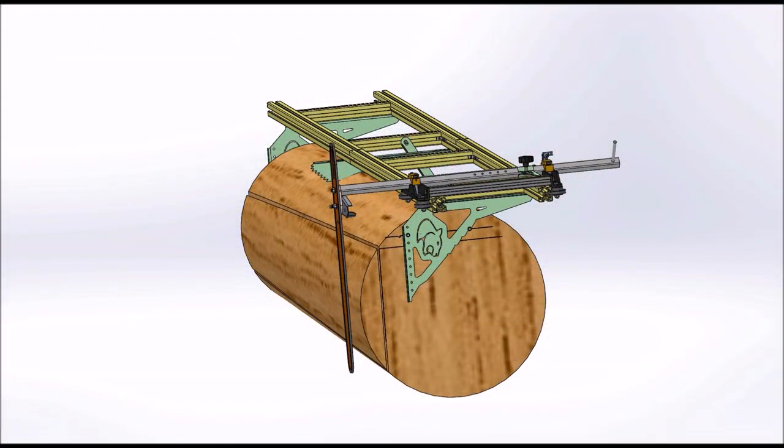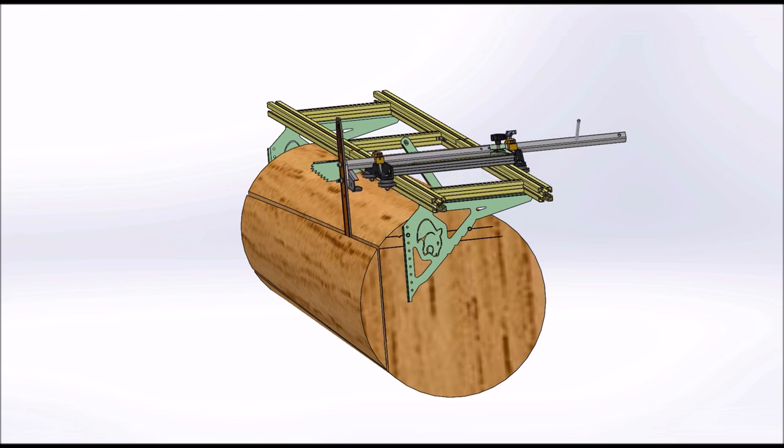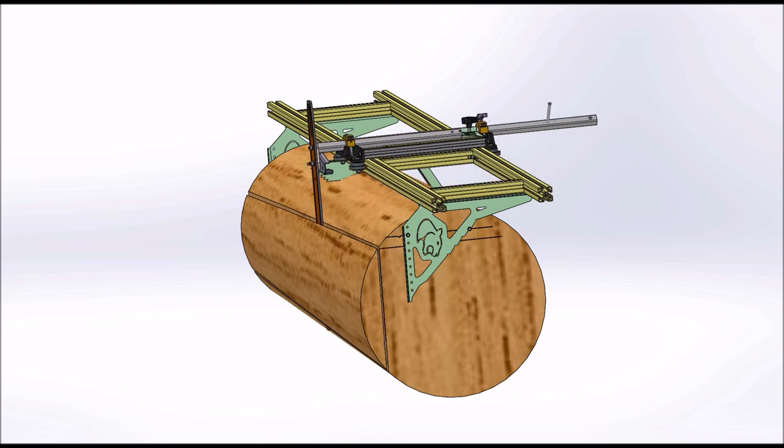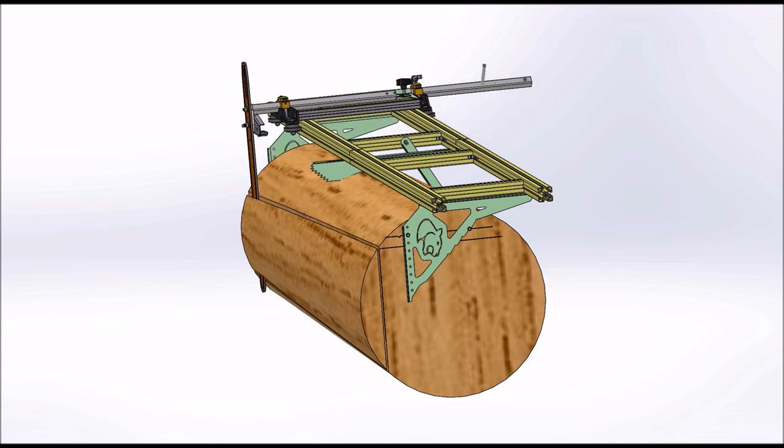Getting ready to do the vertical cut. You can adjust where the bar lies there quite easily. You can do it by measure, or you can do it by eye, and you can see that little stop, and all of this top post slides in and out. You do that by adjusting the end clamp handle. At the other end you get the clamp, so it's just gripping it just enough to hold it steady, but not so it impedes the in and out of the post there. And then you can do that first vertical cut wherever you like.